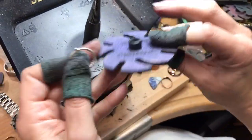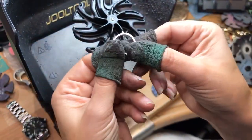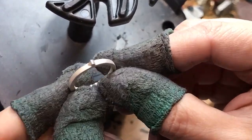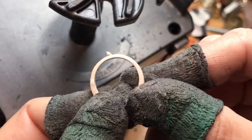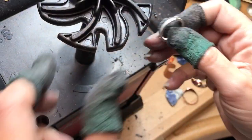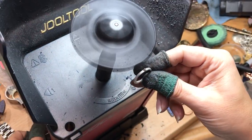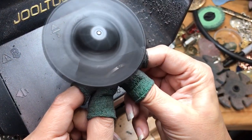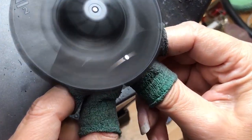I'm going to use the 120 ceramic. We're going to remove the sprue. It's a raw casting this gentleman just brought me, as you can see — it's a sprue, it's a raw casting. I'll go ahead and run it at full speed, and I'm going to grind this sprue down. Within seconds, it'll be down.